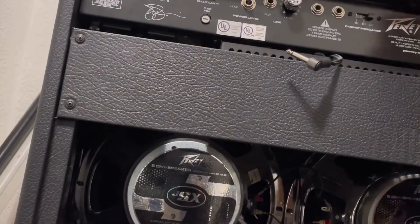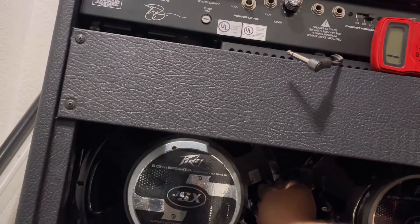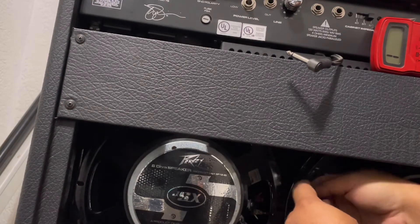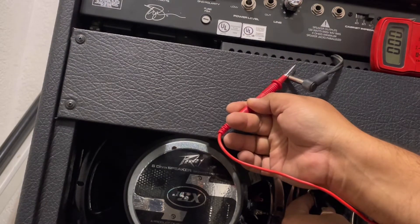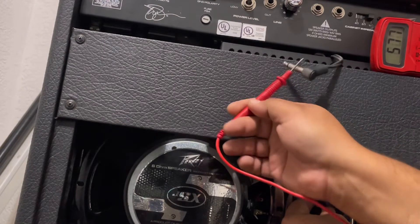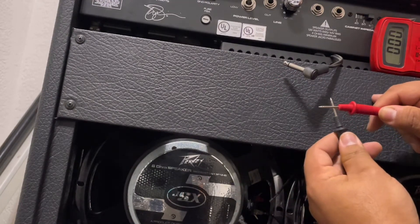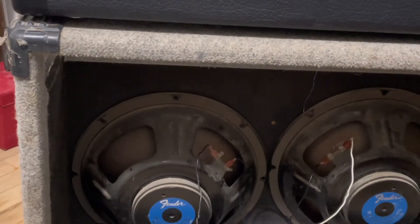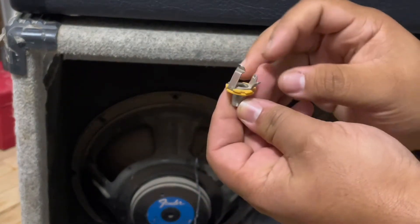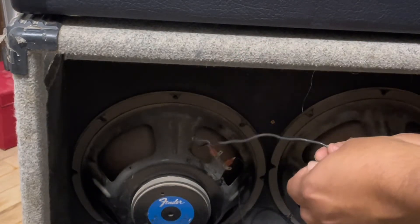Now we've got to find out which one is the tip. The way we do that — you need a voltmeter. If you don't have a voltmeter, don't do this; take it to someone who can. So that's your positive right there. I'm gonna go ahead and put this one here and touch it to the tip — we're getting somewhat of a reading. Put it there: we're getting a one, we're getting a zero. Now let's see what we get when we put them together — getting a zero. So positive is tip. That's how you tell. Your tip is right here, and that's your sleeve.